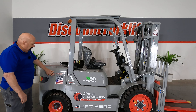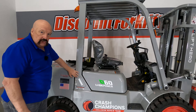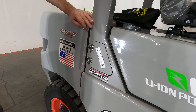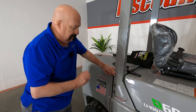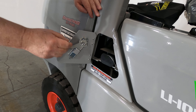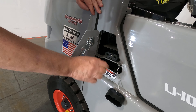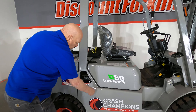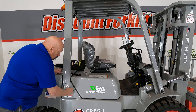Let's talk about the forklift. Right next to our name tag here, there is a door — this is your charging port. You'll notice underneath there's a sticker: please turn it off and remove the key before you charge it. Very important. Turn the forklift off, take the key out before you do this. There's a little push button to open the door. There is a rubber plug on here — keep it clean, pull that off, and plug your charger in. The charger will be in a cardboard box on the back of the forklift, and it plugs into any 110 outlet, so it's super simple to charge.